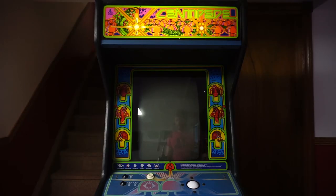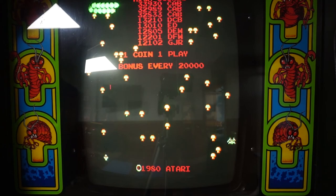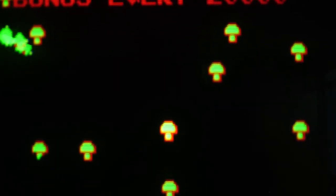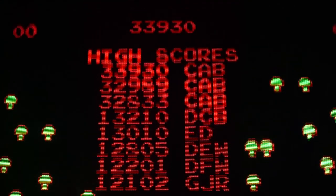So I mentioned before that I think these universal chassis have a place in the modern arcade. Here's my slightly wacky Italian Centipede cabinet. The monitor was a Hantarex MTC900, which is known to be a pain to work on, and the burn-in was terrible. So once again, a tube was harvested from a consumer TV, this time a 19-inch, and mounted in the cab along with another universal chassis. In this case, the results are excellent. The game is bright, focused, and the background is properly black.